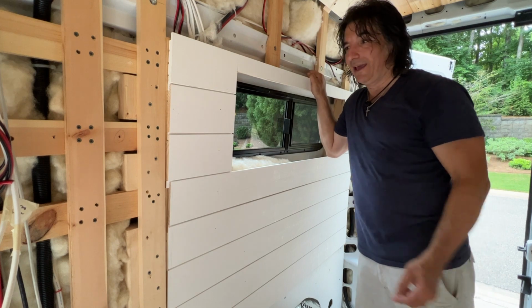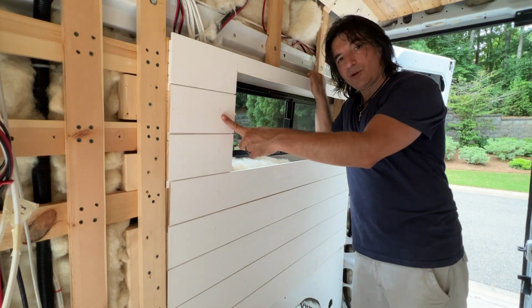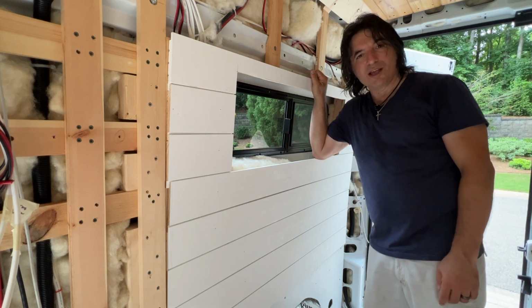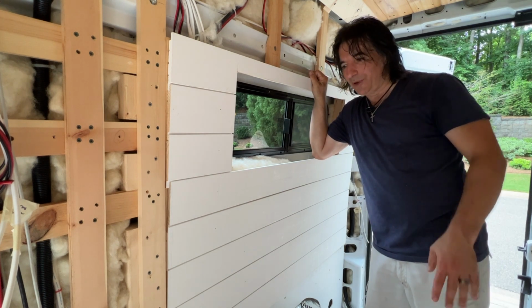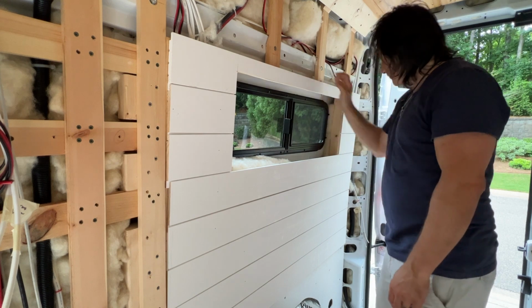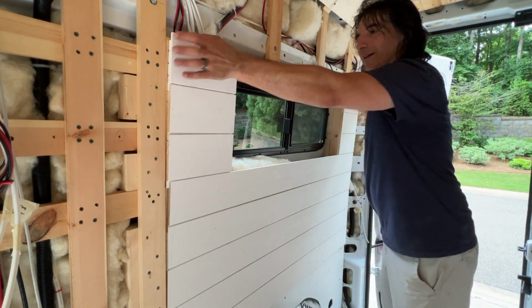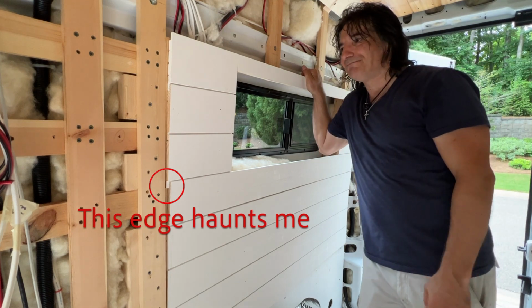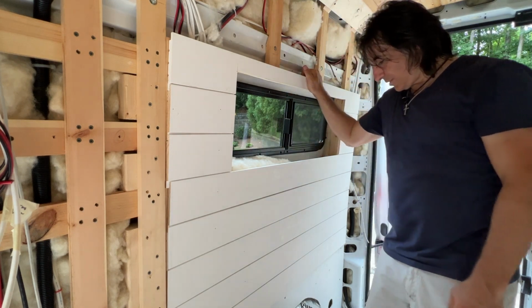I'm going to go ahead and countersink and put the 1 1/4 inch screws in here. And I know I've probably got too many of them on the other wall, but I want this thing to be solid. We're going to paint over the screws anyway, so figure a few too many is better than a few too few. So yeah, time to screw these in, and then we'll start building the frame.